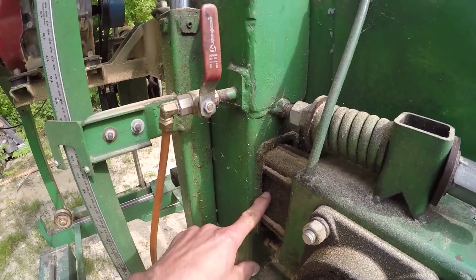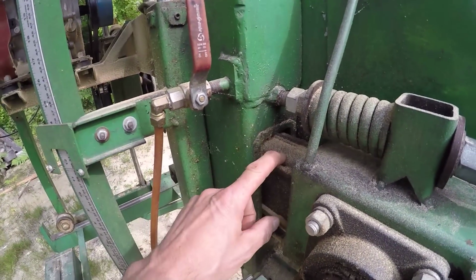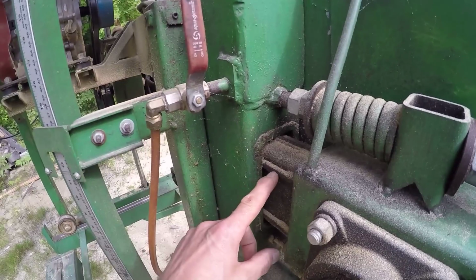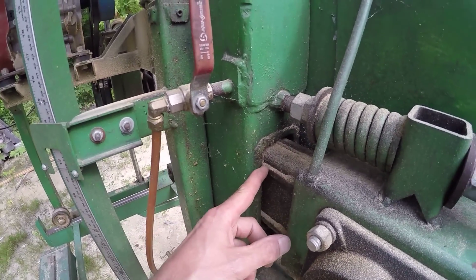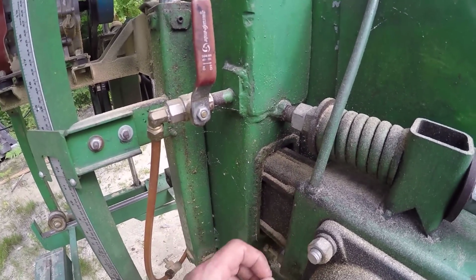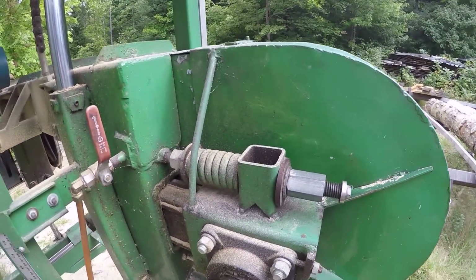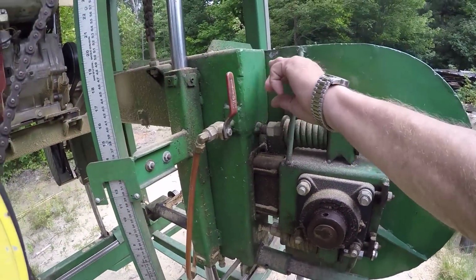Okay, this channel has to be a 1/4 inch bigger. No, 1/2 inch bigger. Oh yeah, 1/2 inch, 1/4 inch all the way around. And the keyways, 1/4 inch keyways. Spacer keyway so that dirt doesn't get stuck in here. Exactly. And there's the tension springs. Yeah, they are fast. They are welded on the frame.